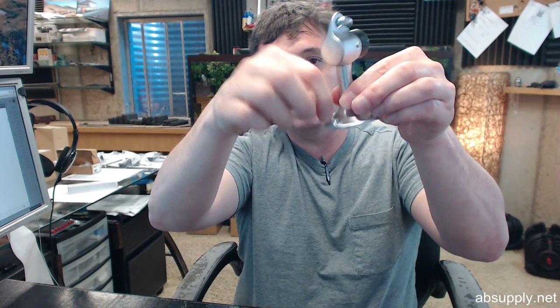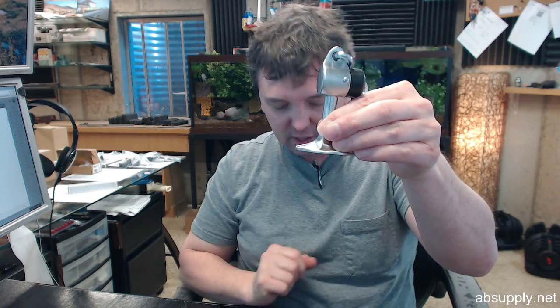Then you will have drilled the hole for the included plastic anchor, and a small oval head sheet metal screw goes into the plastic anchor — that hole just keeps it from spinning. So you need to carefully mark both holes, get your anchor set or pre-drill, install and thread it down, run your screw into the plastic anchor, and that is your installation. Then you have the door portion here.